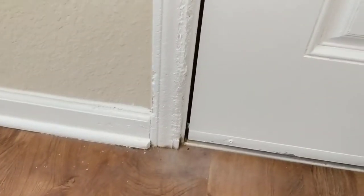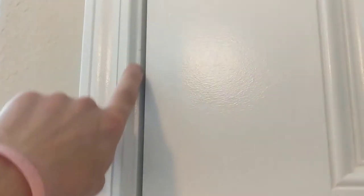What's going on guys, today we're going to be replacing a piece of door trim. As you can see here, the resident moved out and their dog chewed it up pretty good. We're just going to take our knife, cut down the side here and then cut down the side here, and we will pry it off. I have a new one already cut, ready to go — nail it in, paint it up, and should be good to go.